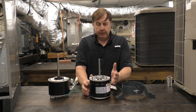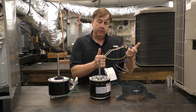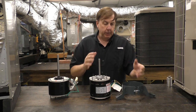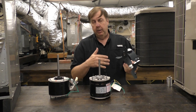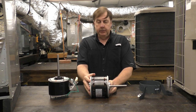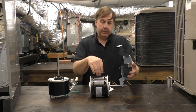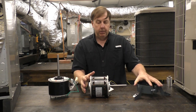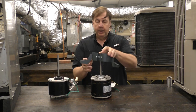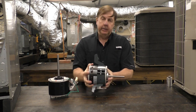In the blower motor, mounting positions can be any one, and we have various speed selections to choose from. A lot of blowers use multiple speeds — typically a lower speed for heat than for cooling. A lot of times with a blower motor we're going to have to add a belly band. Blower motors most often mount this way and go into the blower housing. The mounting ears are typically welded to the side of the motor to hold it in. When we get a universal motor, it won't have that, so we can buy a belly band that slips over the motor, tightens up, and now we have our mounting ears to mount it to the side of the blower.